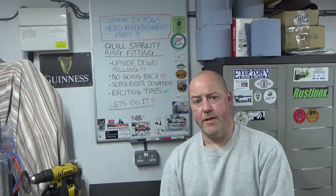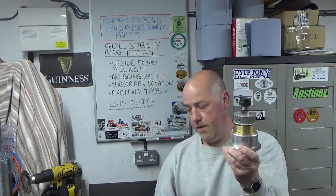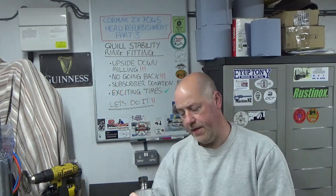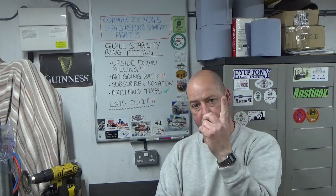So I've had a very kind subscriber donation, and I'm going to call it out. This is Dave Ticehurst in Australia. I've been talking about this for quite some time with Dave, and Dave very kindly earlier this year made me in his own workshop a couple of spindles that will attach to each other with a belt drive, and one of them has got an ER16 collet on, so that allows me to fix both of those to my mill table, have a cutter in the collet pointing upwards, and hopefully machine the underside of the head.